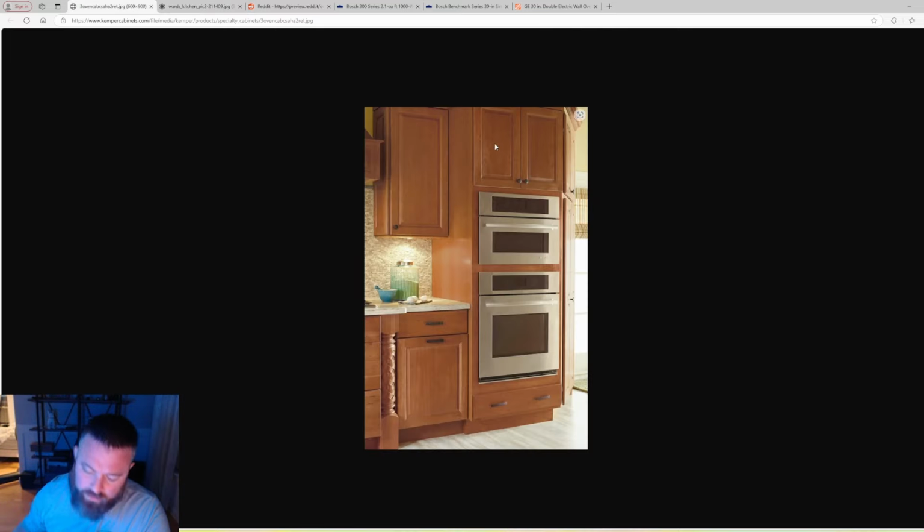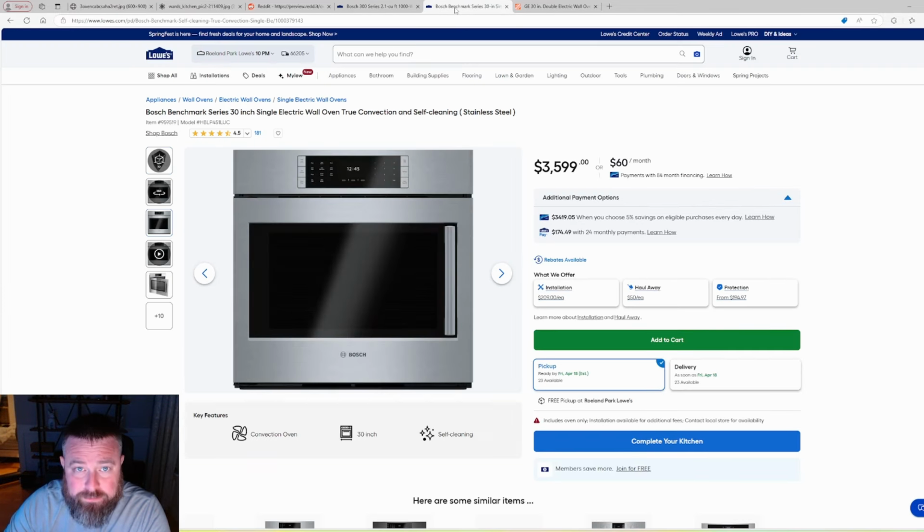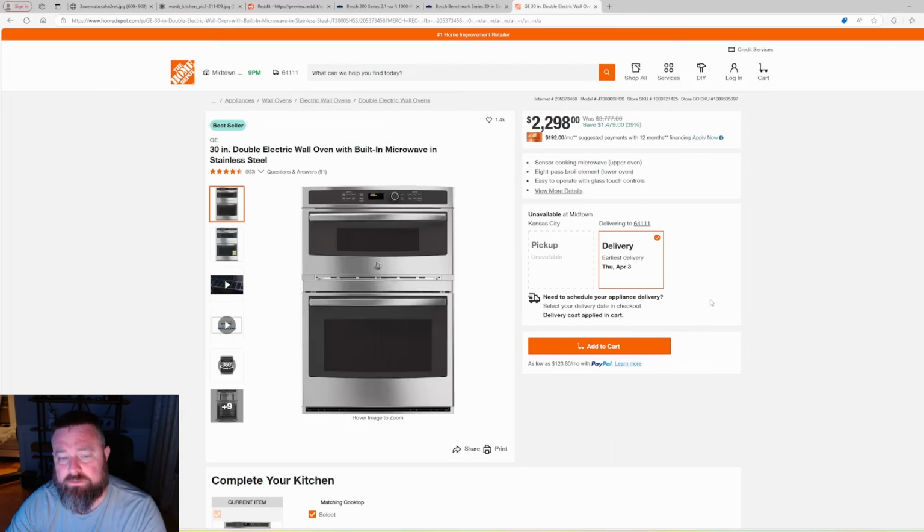Before I can do anything, I have to have an appliance list provided to me from either the client or the builder or whoever's making that decision. You really have to know what appliances they're going to buy, because all of them are different, and unfortunately there are no standards you can count on and be safe. Once I get an appliance spec from the builder, then we can start figuring out how we're going to make this cabinet.